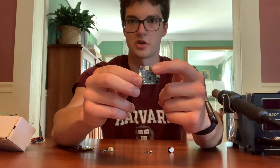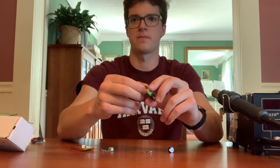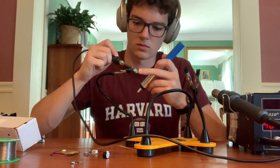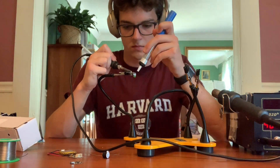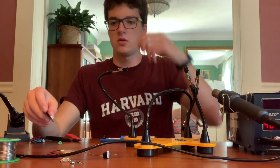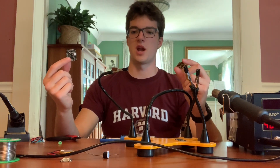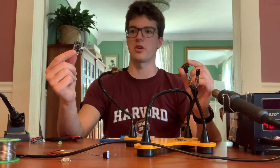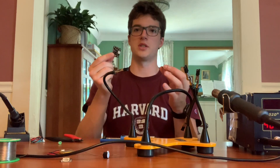The first thing I'm going to do is unsolder this terminal block from the battery charger — it takes up a lot of space on the board and I don't think we're going to need it for this project. Then I'm going to wire the battery charger to the microcontroller itself, and then attach the buzzer and the lightning sensor. Since the charger is the biggest part, I like to build everything off of it when doing a freeform circuit. I'm going to leave the leads a little bit longer so I can fold everything into one another when it's done, so it's nice and compact.